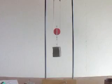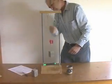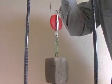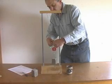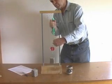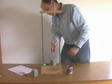Let's try lifting our load with a pulley system configured like this. This time, we have attached our pulley to the load. Engineers call this a movable pulley because it moves up and down with the load. Attaching our Newton spring scale, we can measure the force needed to lift the load with the movable pulley. This time, our scale indicates a force of 2 Newtons. The movable pulley allows us to lift a 4 Newton load with a force of only 2 Newtons. This movable pulley is doubling the input force. Engineers say this simple machine has a mechanical advantage of 2.